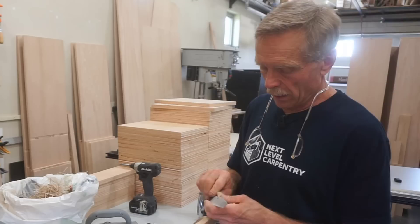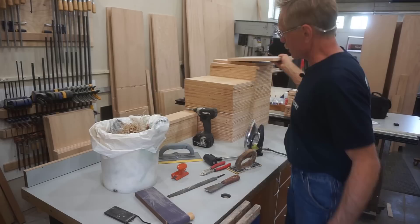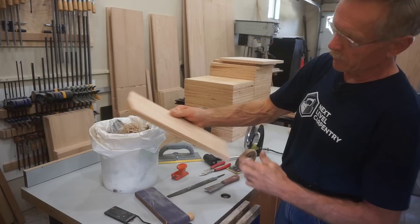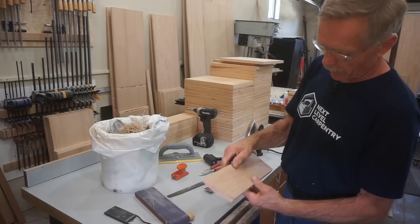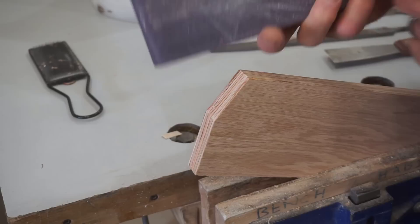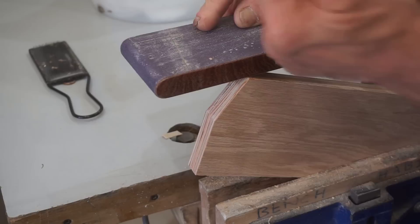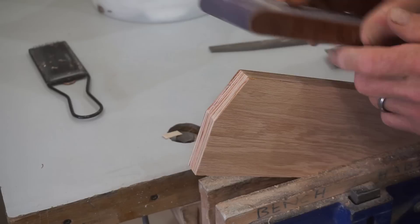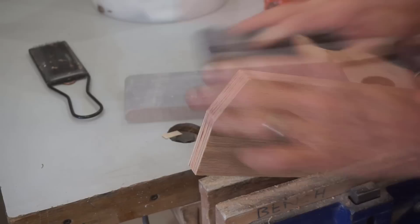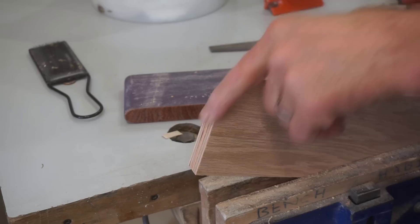I wanted to show a couple more things here. This is a shelf cleat — the closet rod goes about here — and I want to put the edge banding on the end and the bottom of this piece. It's got really crisp corners from the way I made the parts, and I want to ease those up a little bit. So I clamped this firmly and I'll zoom in to show how I use this 120 grit sanding belt on this block. If you want to know how to build sanding blocks like this that firmly hold a belt sander belt, there's a link to the video I did showing you how to make these. I just hold it flat on the surface and roll that sharp corner. If I was to use a soft, squishy sanding block, it would kind of round off the edges and not make for a good fit.